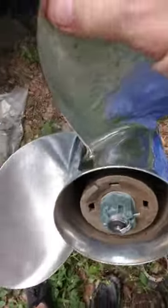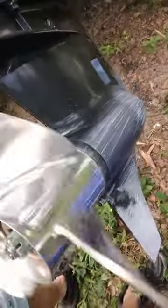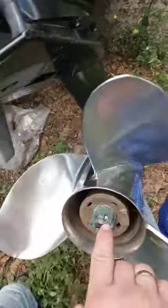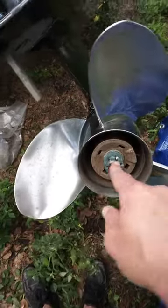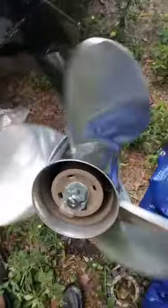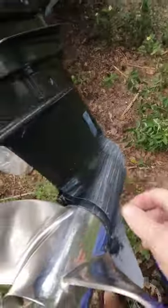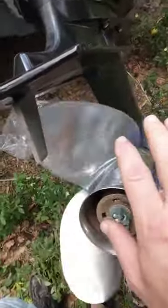What that's going to do is cause a huge vibration. I'm sure this customer noticed the vibration but didn't know what it was — they hit something. Now that the prop shaft is bent, the yaw of that prop shaft is going to be going back and forth, yawing inside of its bore. It's going to end up eating the gear case seals out, then water is going to come in, and they're going to eat a gear case. It's a Suzuki, so I doubt the gears will come flying out the side, but it's possible.